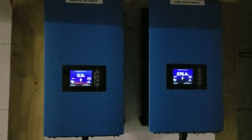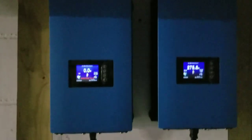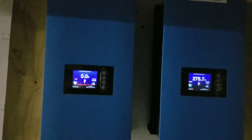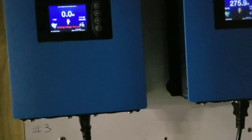I'm playing with the numbers to make sure everything works well when Dave is not home — so a breaker doesn't pop. If a breaker pops, it's actually a good thing because it protects the wire. Breakers protect the wire, not the equipment — it's a thermal thing. When it reads the temperature rising, it does what it's supposed to do.